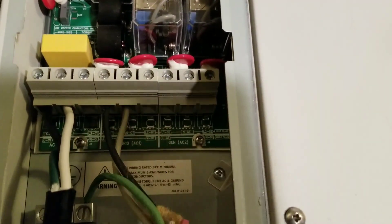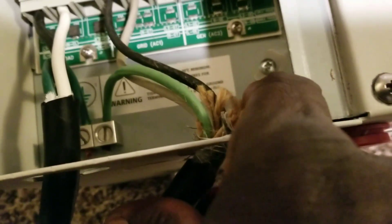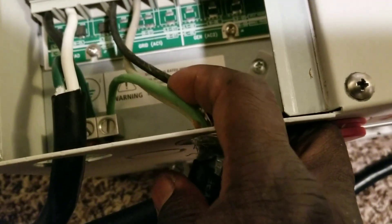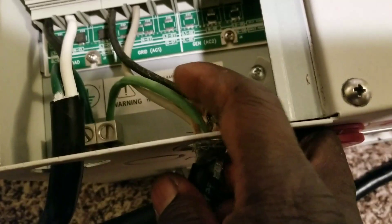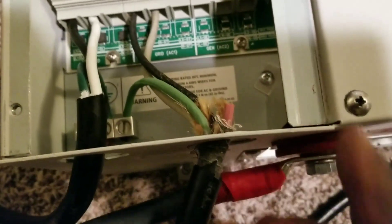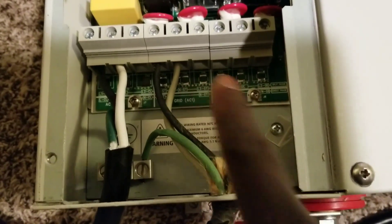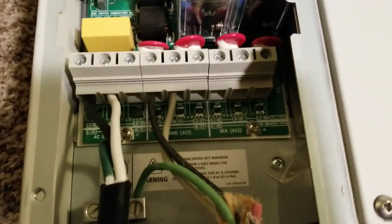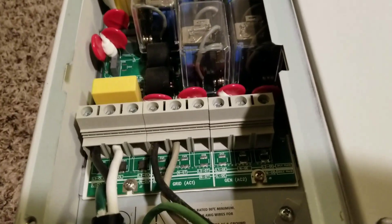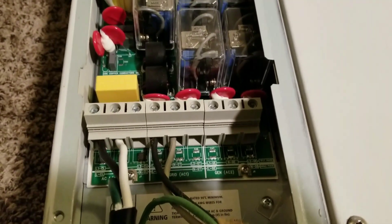If I want to do two legs for the AC in, I put one more wire on this one here. The wire is going to be exactly like this one — you see this wire, it has a lot of insulation on it. These are 240 wires. I have to cut the red wire off, so you have L1, L2, the neutral which is the white, and the ground. The red one would go on the other side right there to make it 240. I'm just testing one side right now to see how everything is working — this is how you wire your inverter to one leg.